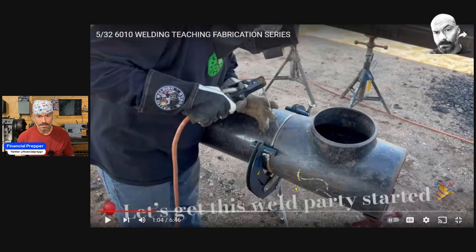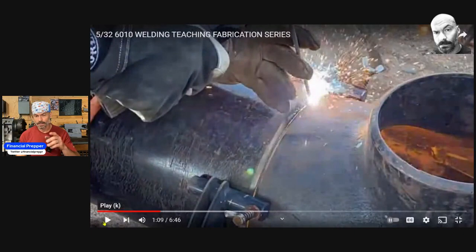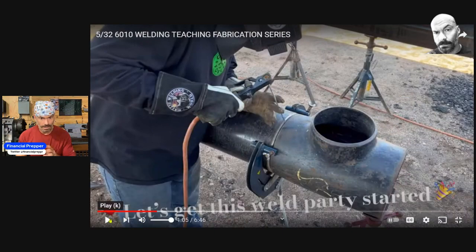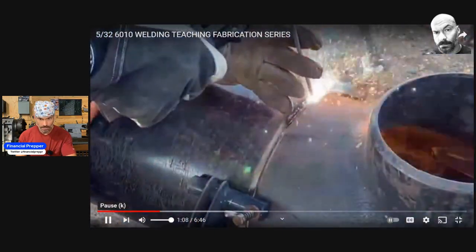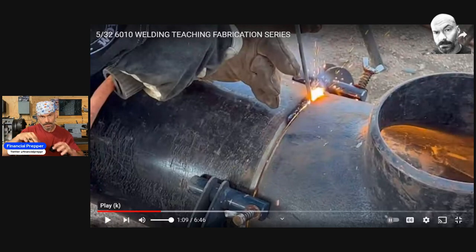Check this out — this is the Welding Professor. He's a good welder too. Everybody welds different — I'm not talking bad about anybody — but watch: he drags the rod three inches before he starts welding. You see all that stuff on the bevel — the BBs and imperfections? From my experience, when you strike down and come all the way back up like that, BBs and crap will stick all over the bevel. Then when you're coming back down, the arc will be in the bevel and a BB will be over to the side, and it'll run you into the pipe wall.